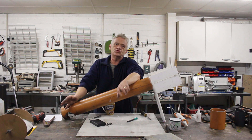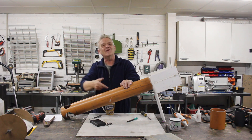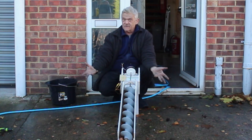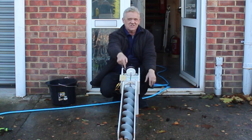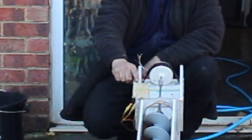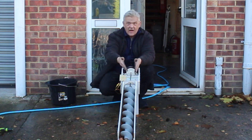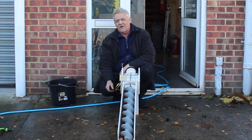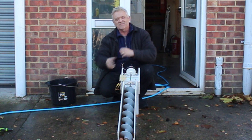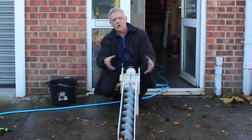I quite like this design, but I also like being able to see into it and to be able to clean it, because it's mesmeric watching that screw go around. So I'm going to take the top off and we'll have a look at it without the top. Here is the open version — it's exactly like the pipe version, I just want you to see the screw turning because it's pretty cool. I've put a motor on here which came from an air conditioner — that's our generator — attached to this little lighting bank so we can see it do something. If you were to use this for rainwater, obviously the rainwater would just empty into there. If you'd been in England this last week there's been a ton of rain — I'm going to bet you could light your house with it. There is power there to be scavenged, and this is a pretty good way of scavenging it. Let's pour some water on that and see it light up.